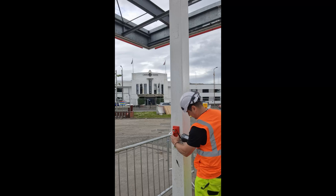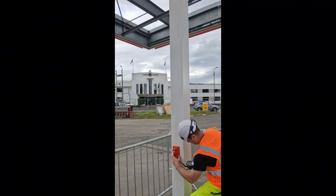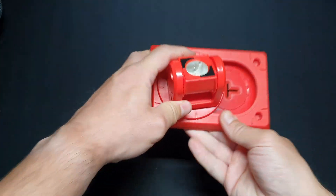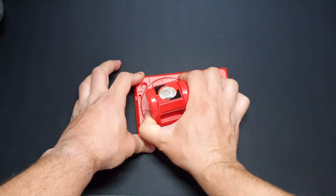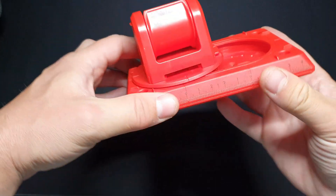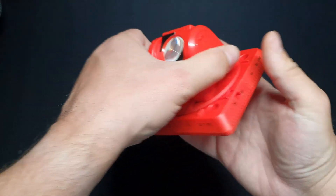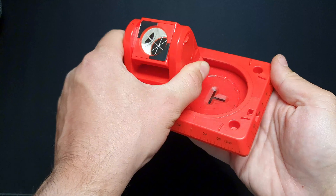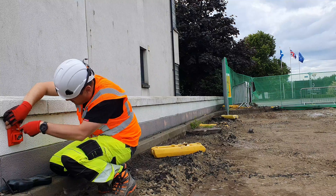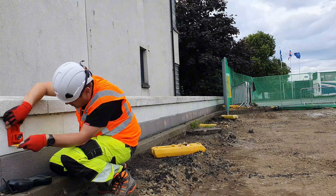The survey aid is also magnetic and it sticks to the steel structure, which can be very useful. I also recommend buying a deep hole marking pencil — I bought a tracer pencil from Amazon together with spare leads. You set out your point and once you are happy, you slide the prism and mark your point with the pencil. The intersection of the two lines represents the center of your prism. You can use it on the wall or on the concrete floor, same as you would with a mini prism, but the marking is more accurate.